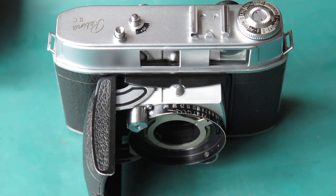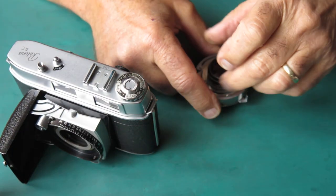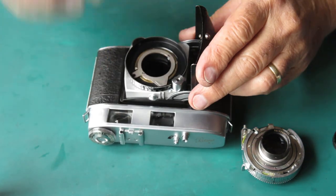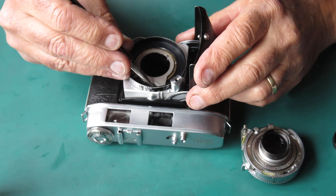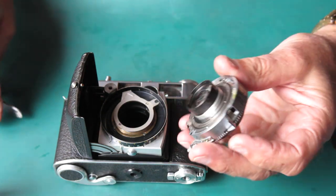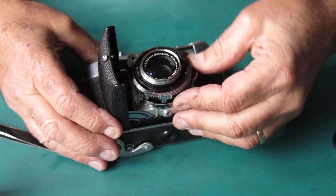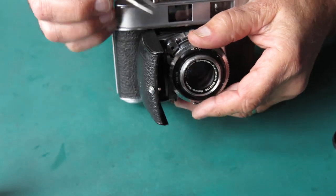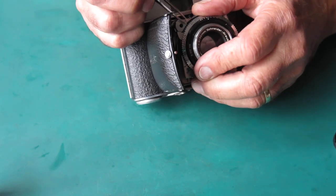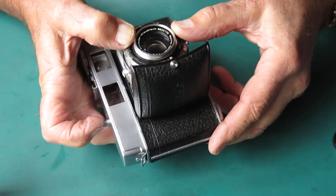With that, the camera body is done. All I need to do is put the shutter back in place. So we have our shutter and lens assembly, all cleaned up, serviced, and ready to go — this should be fairly quick. Check this is all back at the infinity position. Now rack that out forward to the forward focus position. Fit my shutter assembly in place and get the curved rack in position. I can see that it's a mile away from where it should be, so I'll just pull that forward and bring that curved rack around.